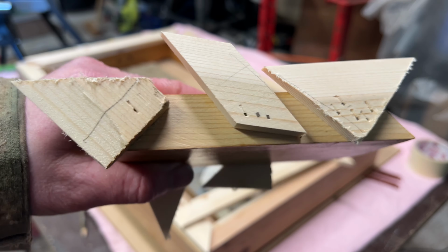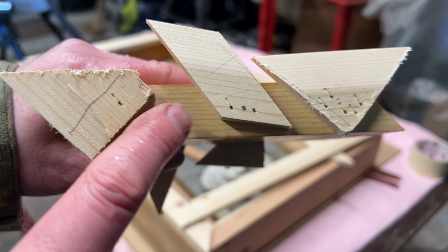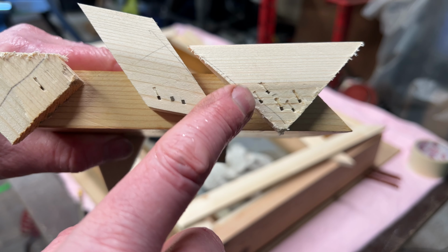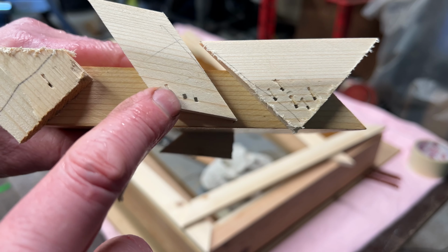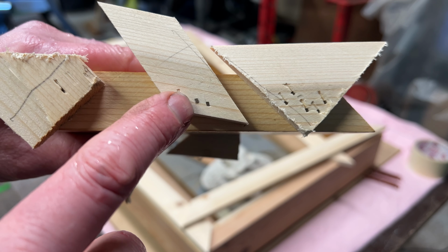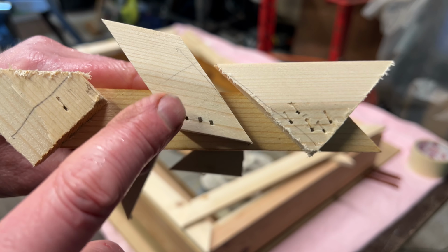I was going to use a staple gun, but I've had a little practice on the same sort of wood that I'm going to be nailing through and into. And although it's on the same pressure or power setting, it's inconsistent and it's damaging the wood quite badly there. Or it's not even going below the wood surface and it's leaving sort of a square head. And these are steel pins that are going in, steel nails.